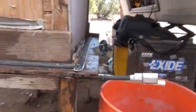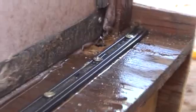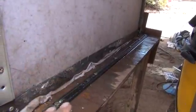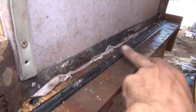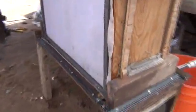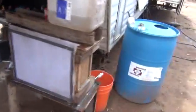There's the quick and easy updates. You can see the tube coming in right at the corner there. You can see this flashing chunk that I had to screw down on both sides — that helps so if the water rolls off the sheet, it'll stop most of it and roll it back towards either corner. I have crowned the center of the refrigeration board — the bottom — so you can see it's dry at the center. I crowned the center with this piece by how I screwed it on, so water rolls to one side or the other and doesn't get caught up in the center. So there's the update to the evaporative refrigeration system — it is now a recirculating system.